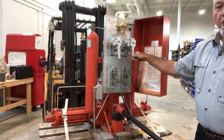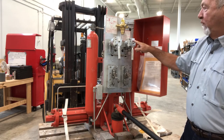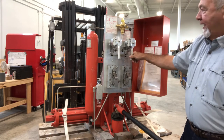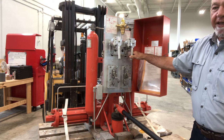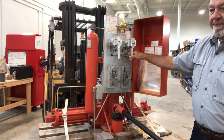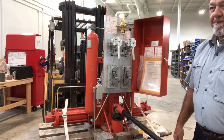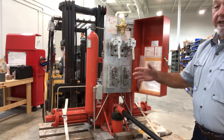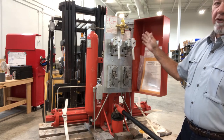I now want to open the valve back up — I go to the opposite again. Both of these are clearly marked closed and open, and I push. This is gas pressure that is now moving the valve to the open or closed position — in this case, open. The valve is now in the open position, and you can sit here and move it back and forth as many times as you would like, as long as you have supply pressure.